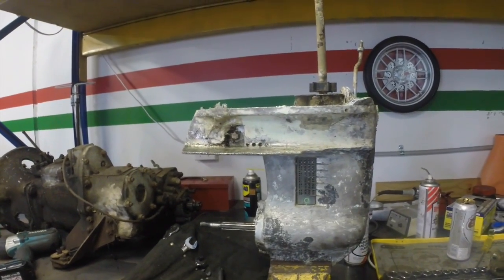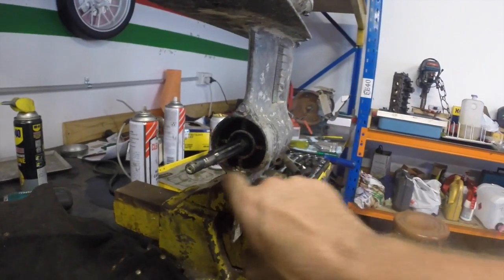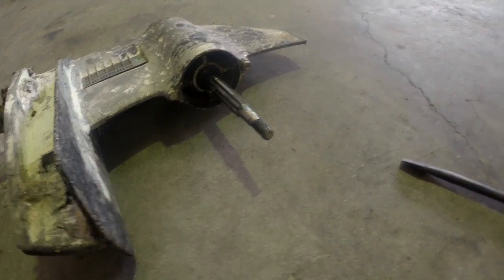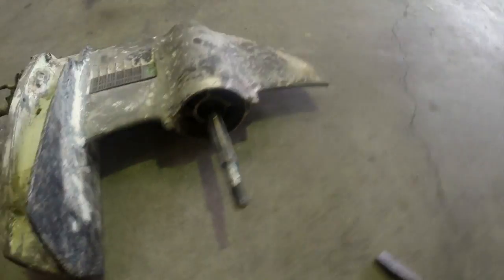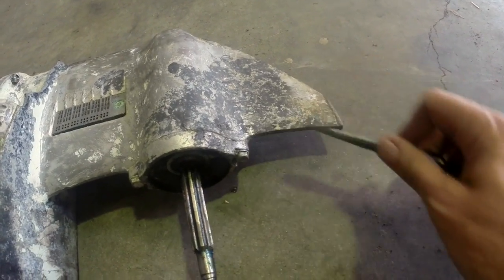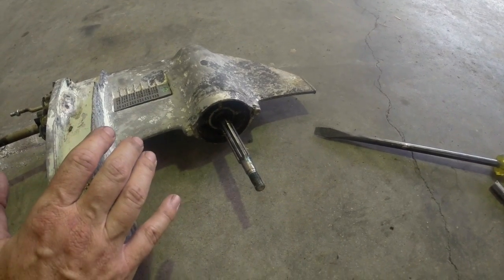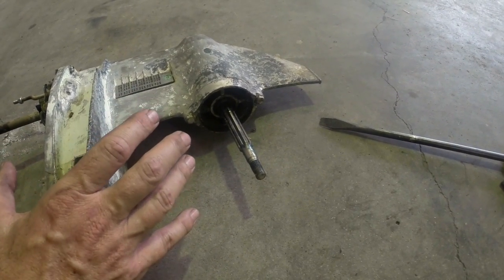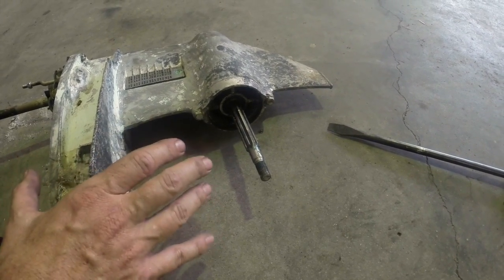That's the whole foot of the outboard. An anode goes here. This is where the exhaust comes down and then comes out around the outside of the prop. I'm also going to try and take the prop shaft out of this gearbox. There's a little bearing housing inside too. It's essentially two bolts, and then often there's a point where you can get a screwdriver and pry it out, use a puller off the prop shaft, a slide hammer, whatever. They're notoriously difficult to get out. So we'll give that a shot - if we can, great; if we can't, chances are you'll probably never see this video.